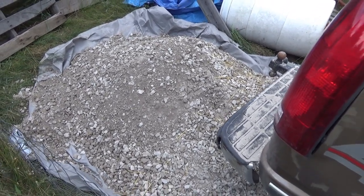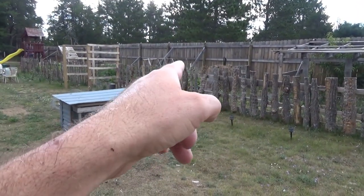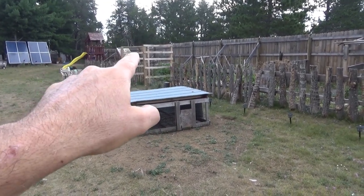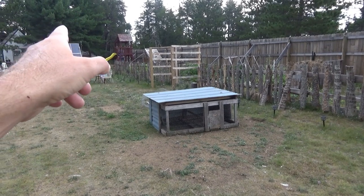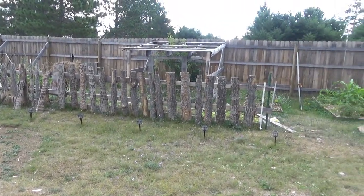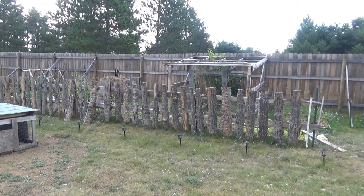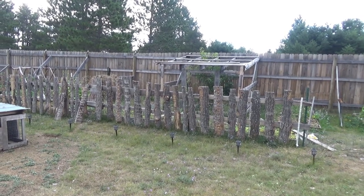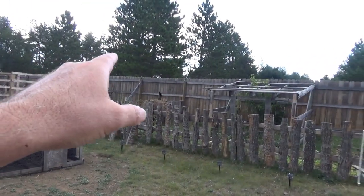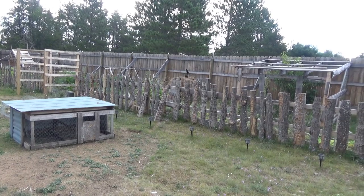Let me show you the plans. One's going here, and one in dead center, and in the end of the gazebo is one, and then again there, and in the end. So I need 4 fence posts in here, and the crushed gravel will hold them up rather than cement, and that'll shore up this fence line too from leaning in the wind. That'll be much, much better. And then I can shore up the main big fence to those. So everything will hold everything better in place.